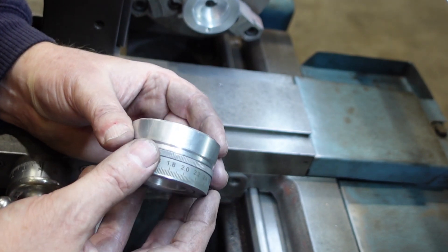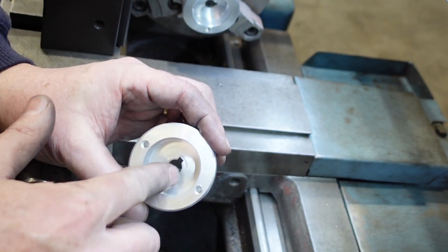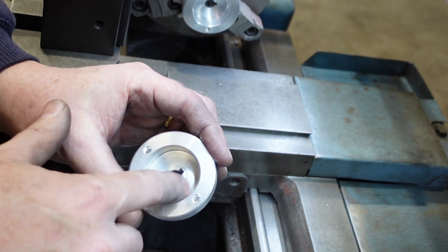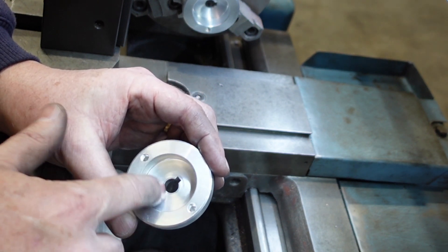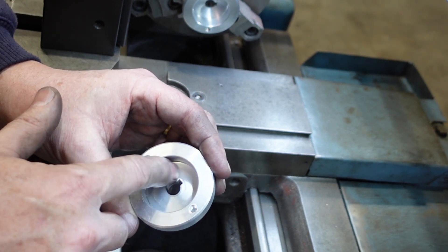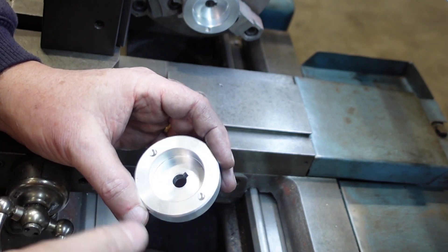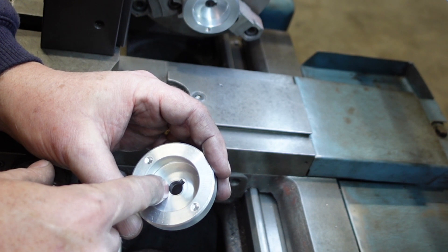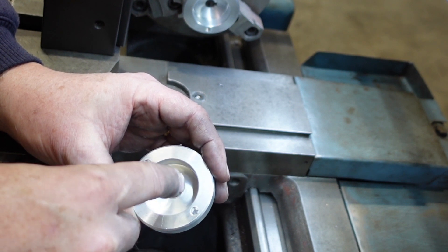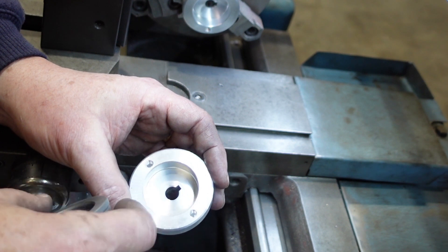I did think at one stage I'd have to remake the knob and the dial, but having another look at them there's plenty of space. So what I'll try first is basically machining that out and then pressing a slug of material in there. That's 10, and that's two mil extra, so that's 14. If I put a 19 or 20 piece of aluminium in there — it's only 10 mil thick — or I could even do steel. That should be alright and I should be able to then bore it, drill and ream, and broach a keyway in there.